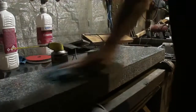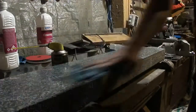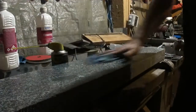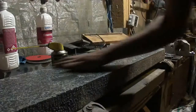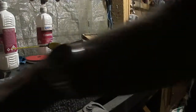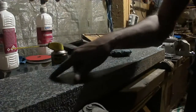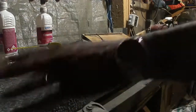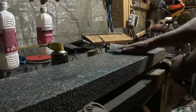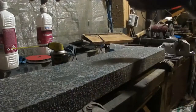First off, I'm about as good as I can get on this particular surface plate with the tools I've got. I'm down to within a hundredth of a millimetre over the whole surface, apart from a couple of spots in the corners. There's a slight low spot here — there's a soft spot in the granite that's low by about five microns. There's a big low spot in one corner, but that's way outside the usable part. So I'm within a hundredth of a millimetre; it's good enough for me.